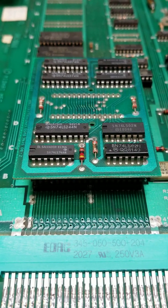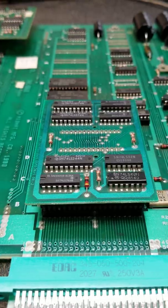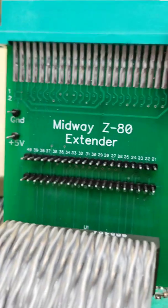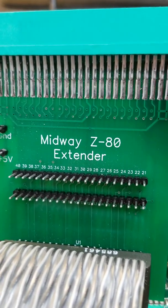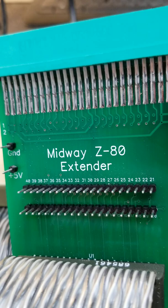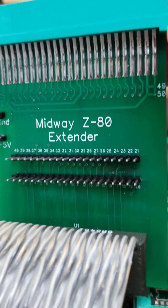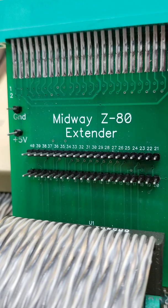Years ago I developed this little board, and you plug it in and you can do one of three things. You can use it just straight like that — plugged in with nothing in the 40-pin socket — and you've got pin for pin for connecting to a logic probe. You've got a ground and a 5-volt there, and then pin 1 through 40 of the Z80 using a logic probe, data analyzer, or whatever. Or, you can pull the Z80 out of the factory socket if you think you have a problem with the socket or with the Z80 itself, and plug a Z80 into this and just use it for a quick diagnostic — effectively replacing the Z80.